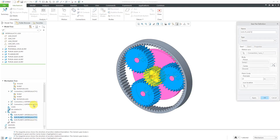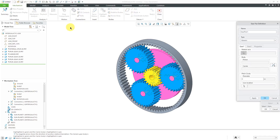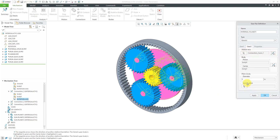Just to verify I have it going in the right direction — if I don't, then when I test and do an analysis, I would see one thing spinning in the wrong direction. So it's very important to check as you are doing the analysis that you're getting the correct motion that you want. Let's create our gear pairs, and this one is going to go from the planets to the internal ring. Let's choose internal planet one. For the motion axis, let's select this one over here — body one is the internal gear. Let's plug in the value here, this is going to be a value of 80. Then for gear two, let's choose planet one, flip the direction, and this is a diameter of 30. Let's click OK.